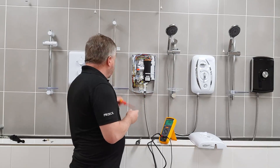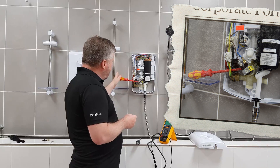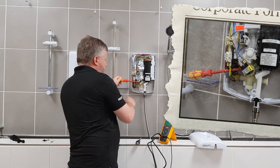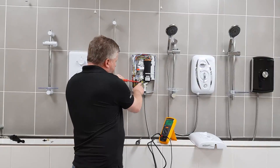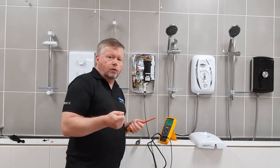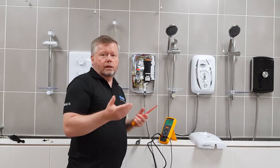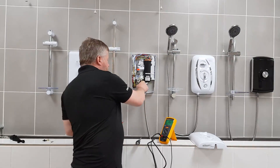To remove the coil, take a flat blade screwdriver and place it between the brown coil and the body of the solenoid, then twist it through 90 degrees. That will pull it off the center spigot. If you're not confident, you can turn the water off before attempting this. That's now moved it off the spigot slightly.